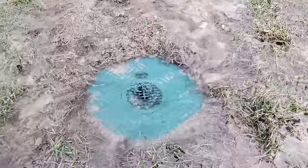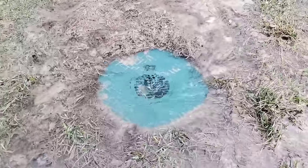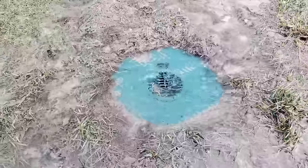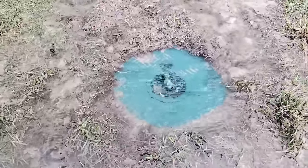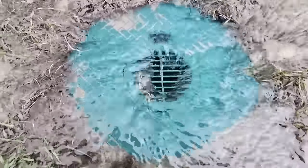You can see when the water's running into that low spot in that backyard, it's the perfect place to collect the water. This is definitely the right way to build a yard drain surface water collection system. You don't want to be bringing in dirt and filling in these low spots — that's the last thing you want. These low spots are found money in my business. You put a collection basin in them, done.